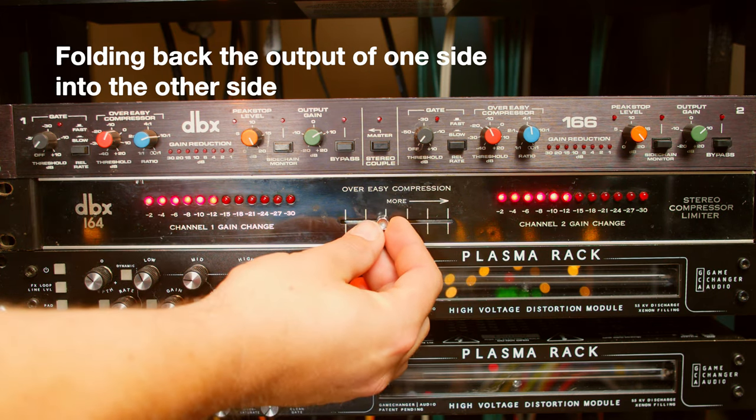So some of these are stereo compressors, and I'm not sure exactly how some of these work, but there's a sum of information that the detector sees. And so in certain cases, the output of channel 1 may just lead to more compression on channel 2. And of course, with more compression, it's also reapplying that compression to channel 1, not just the second channel. Really, really bizarre things going on here.